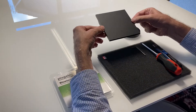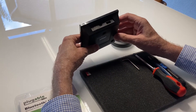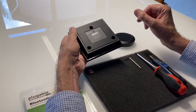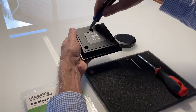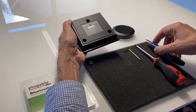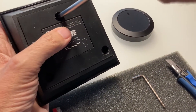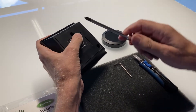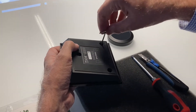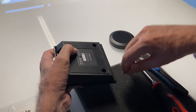First we have to open the box. The box has no visible screws because they are hidden under the rubber surface on the rear. You need a cutting knife to open these holes. I already did that — I took out the rubber and inside you can see three screws. These screws are different: the first one is a normal cross screwdriver screw, and the other two down here are very small tiny screws that you open with the 2.5mm tool.